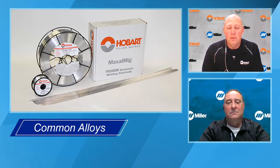Now, 4043 or 5356 might not be the perfect filler metal selection, because the application is going to dictate what the best filler metal is, but the welds will hold. So yeah, 4043 and 5356 are the most common. The biggest differences are the alloying elements. 4043 has roughly 5% silicon, and 5356 has about 5% magnesium. Those different alloying elements really change how they perform and how they weld.